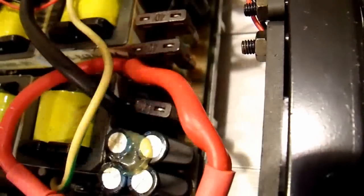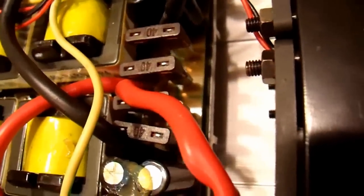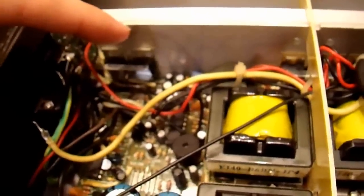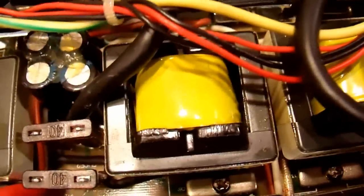First, the good things. I like the way the airflow works in this. They have these two fans over here which supposedly are temperature controlled, and there's some space underneath here between the top of the inverter and the bottom of this heat sink, so air can flow underneath all the way out to the other side and also along the side. This is nicely ribbed. They have all of the power FETs on both sides — the high-voltage power FETs over here and a few pairs of low-voltage FETs back there. That looks like it's all designed pretty well, but that's really about all I can say that's good about this thing.